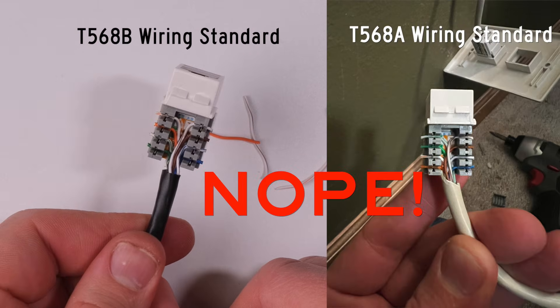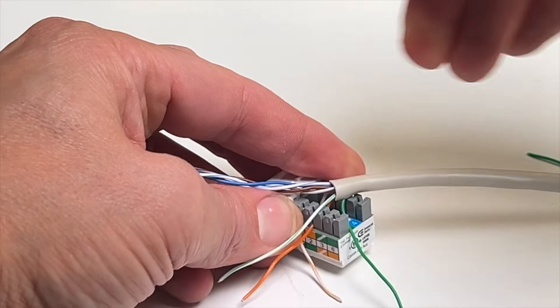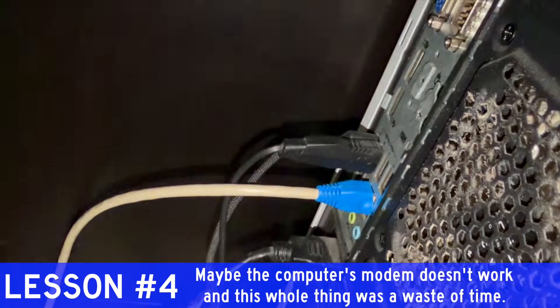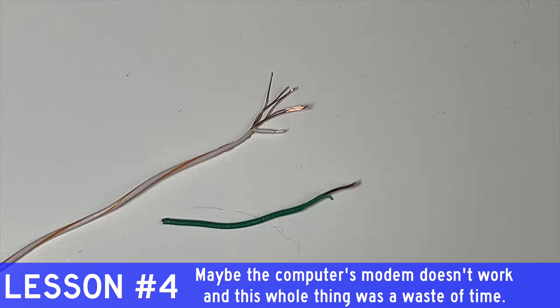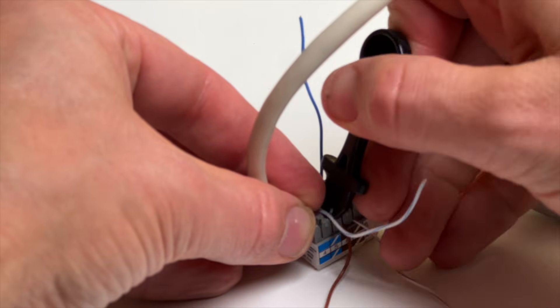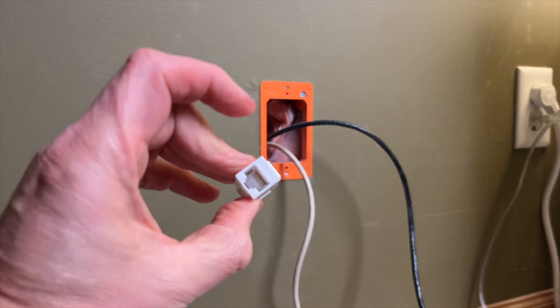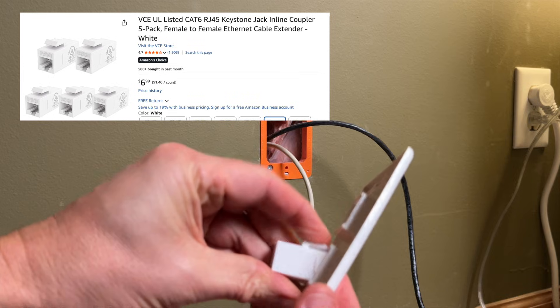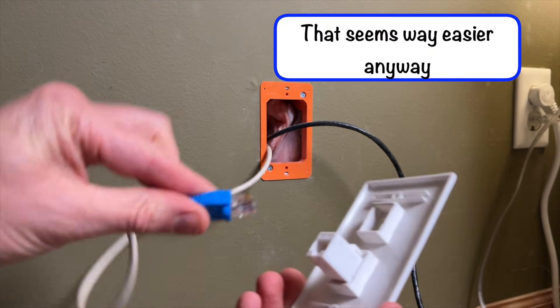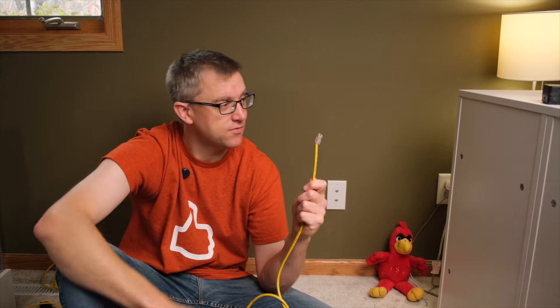Here are some things you can check to make sure you wired everything correctly. First, are the wires in the same order on each jack? Take a photo with your phone — it just makes it a lot easier than trying to remember. Second, are the wires in each slot punched down all the way? Different jacks use different punch tools, and if you use the wrong style, it may not create a solid connection. Third, are you sure your modem works? That's lesson four I learned the hard way. And finally, are you sure that the cable you're using is solid core wire and not stranded wire? Stranded wire will fit in the slots and look connected, but the blades will not cut all the way through the insulation, so it will not make a connection. If that's the case, you'll have to run a whole new solid core wire from room to room, or you can get a female to female inline coupler, add an RJ45 connector at the end of the cable, snap it in, and you're good to go. If you want to learn how to add one of these connectors to your ethernet cable, check out this video right here. Thanks for watching.